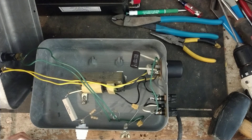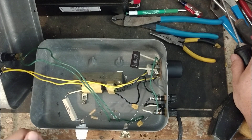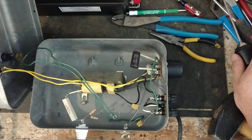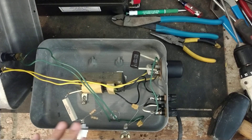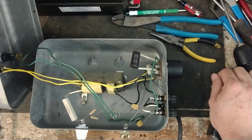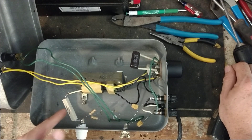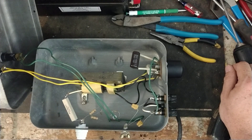These don't shock like the newer ones from the late 70s, early 80s, and current models. They're not solid state and not a low impedance unit, so they don't pop you and hit you like that. They're a long duration shock. These also output an AC voltage — the unit I measured earlier was putting out roughly 600 volts AC. All the newer low impedance ones output DC voltage, like 6,000, 7,000, 8,000-plus volts DC. These older units were high voltage AC every time they shocked.